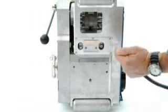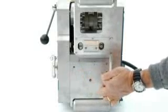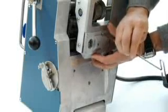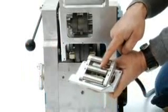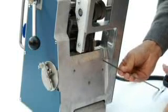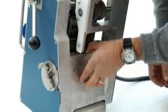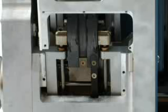To access the cartridge heaters, remove all the screws from the contour rolling plate on the bottom of the machine and the weld plate below it. The contour roller and bearings can be cleaned if necessary. Take off the welding plate. Remove the 3 screws on the wedge, drop the tail housing down, and the wedge will split in half, revealing the heaters.